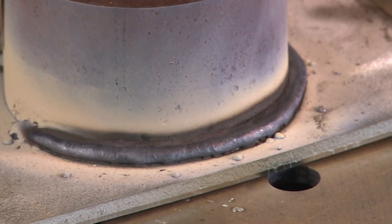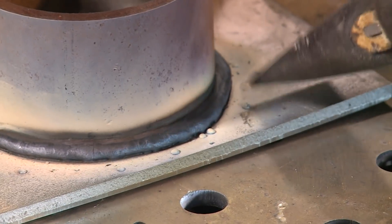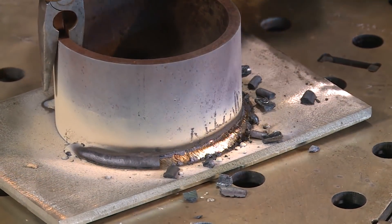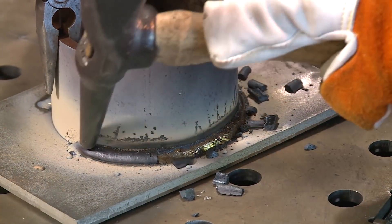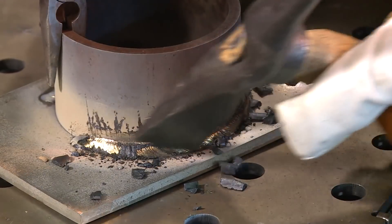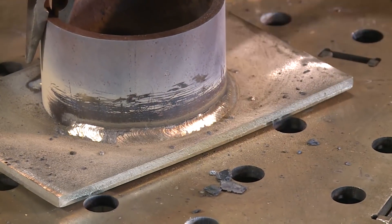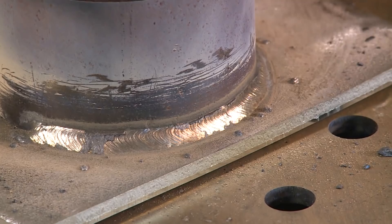I'm going to let this cool for just a second. I did get a couple of spots of some heavy dingleberries that came off and stuck to the stainless plate. I'm not one to beat this up because I've gotten hit before — hit in the face, hit in the neck — and this stuff stays hot for a really long time, it will burn you. Fairly consistent weld, it has some decent color to it. It rounded up some — laid flat back here and rounded up a little bit. I think that had a lot to do with my rod angle.